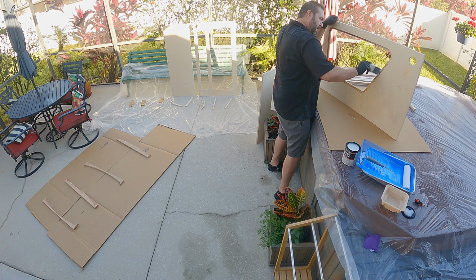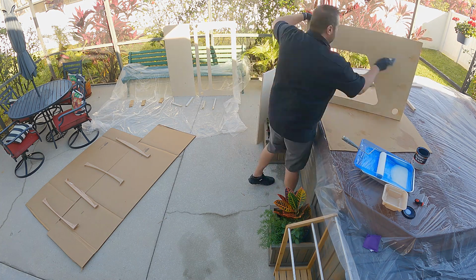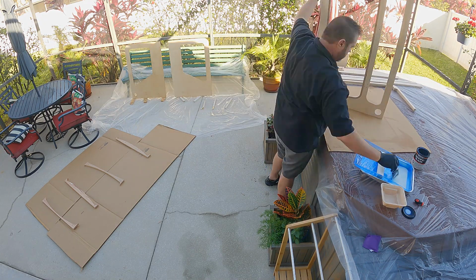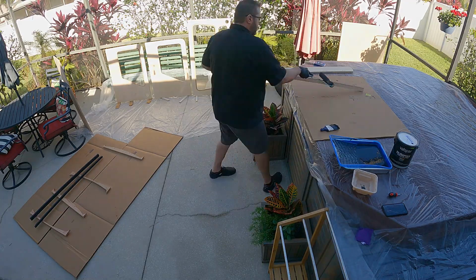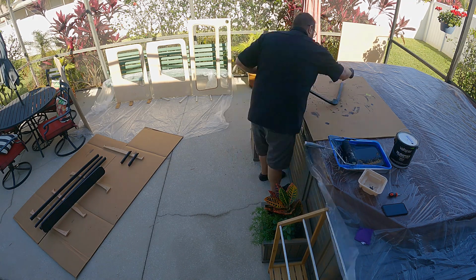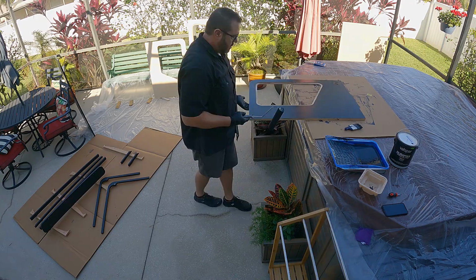With that, the first thing I did, the cuts were really clean, I didn't have to do a lot of sanding, but I did use a sanding sealer on everything. That was the first step. Kind of get that grain to raise and sand it so that it'll save me some coating a little bit later. Once the sanding sealer had dried and I sanded it one time around, next was to hit it with latex acrylic that I used to paint them all jet black. All of these parts were just painted with the same foam roller and touched up with a small detail brush.